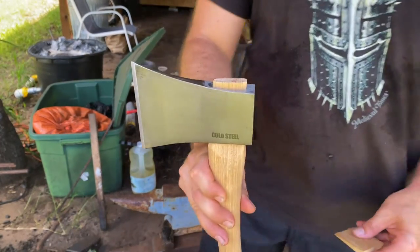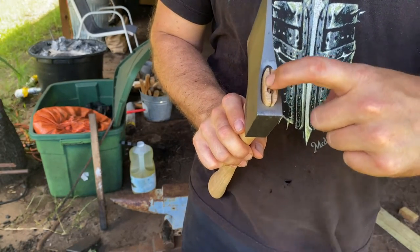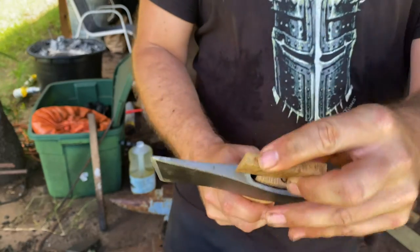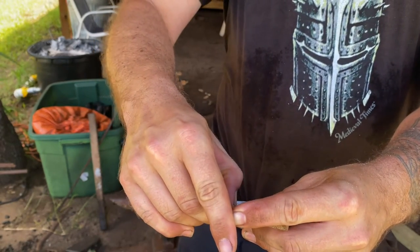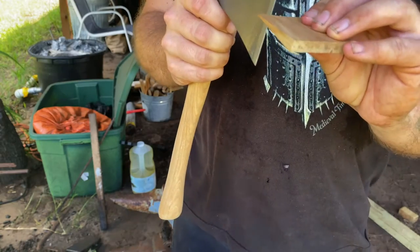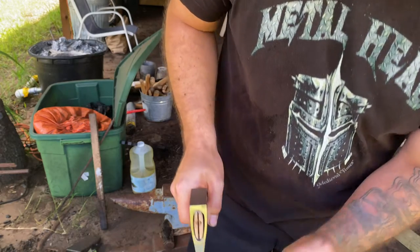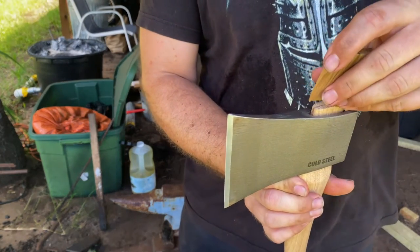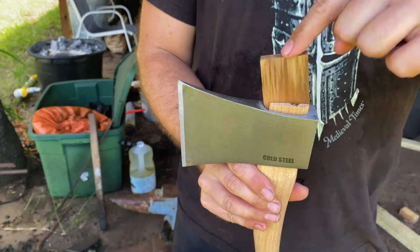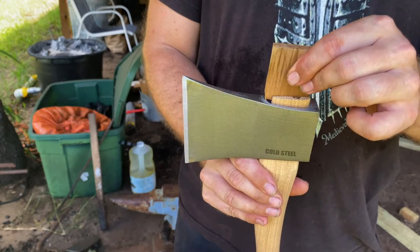The next thing to do: there's a slit right here, and this big slit is where the wood wedge goes. When you order the handles, they come with a wedge — they're a little oversized, which is fine. I just use my fingernail most of the time to mark it, and I usually have a knife. Instead, I'll just use the axe and give it a little split so it goes in there. I'm going to dab a little wood glue and then glue it in. Set it all the way down — don't go pounding away at it because you can break the wedge — just seat it all the way down in there.